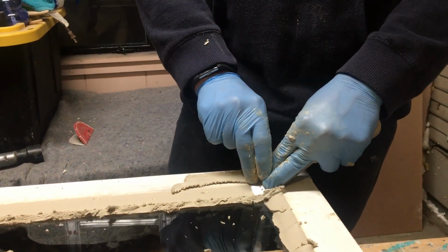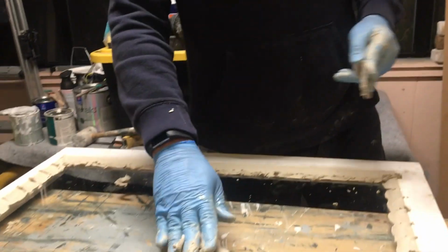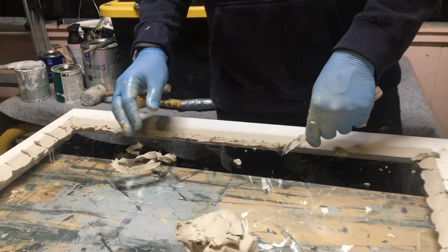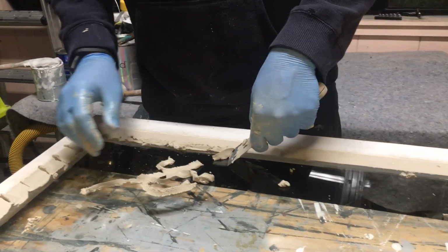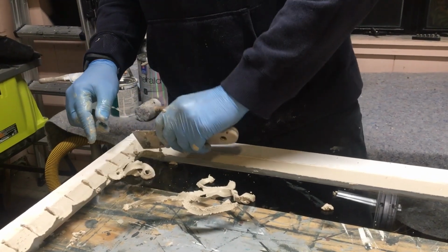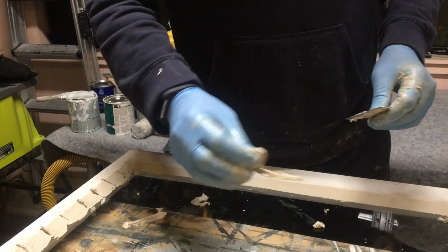And you'll feel a little pressure on the glass with it dragging along, but don't worry about that. You're not going to cut the glass as long as you're not pressing too hard. And don't get crazy. But okay, and you kind of pull off the string of glaze there. It's always nice and easy when it's real thick.